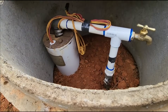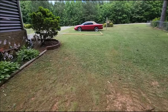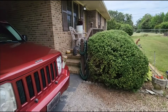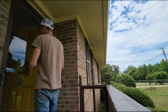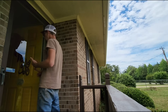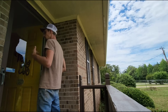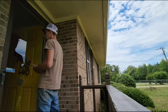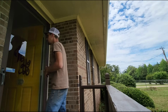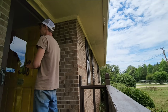Hey, you like the way that looks? A whole lot better than the way it was. I'm going to head inside now, turn the breaker back on, make sure we got good water. On the way to go tell the homeowner to turn the breaker back on — make sure the water's good to go. We put chlorine down in your well — it's going to sanitize it. It's probably going to get really red because we pulled the pump out, so be careful washing clothes because it will bleach them. The more you use water, the faster that chlorine will get out of the well. You should be good to go. The total is $2,000 — that's what we talked about. Nothing more owed today — we'll call that even. I try to be a man of my word on what I tell people it's going to cost.